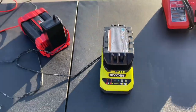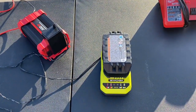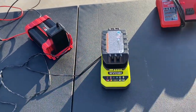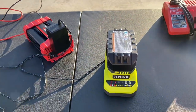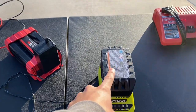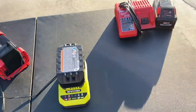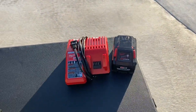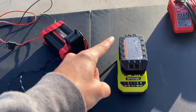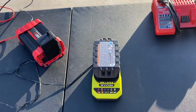This is really a good system — remote jobs, when power goes out. You don't have to use this system just to charge tool batteries. Tool batteries are actually a good option to store power, because you can buy inverters and do a lot of things with them. I've got an inverter for my Milwaukee and an inverter for my Ryobi. These are good things to store power. I will be showing you in another video what all you can power with 200 watts.